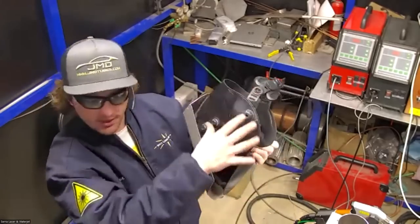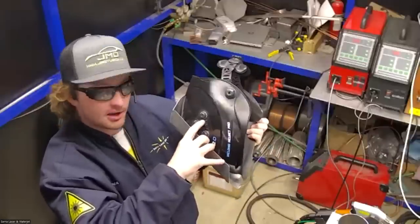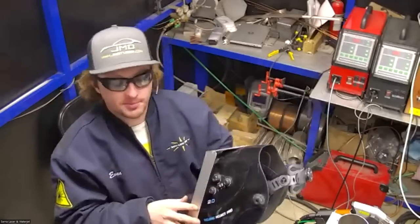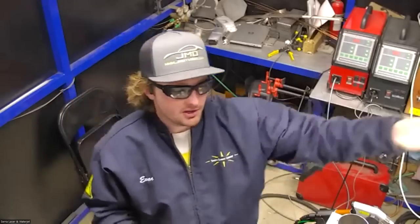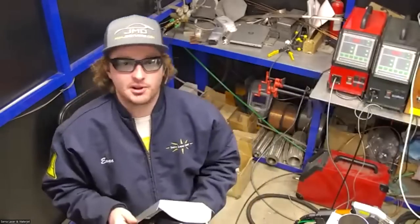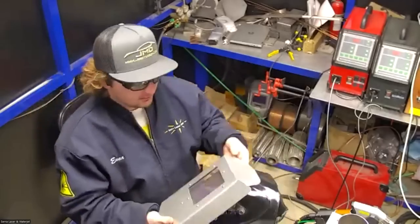You can probably tell that it's a real standard welding helmet here underneath. We're actually just going to put it on cut mode because there is no arc. There's no UV light produced by an arc, so it's not very bright. It's much dimmer than what we get with a TIG weld. In fact, I like to have a nice bright light source to help me see what I'm doing a little bit better. I have it on cut mode with a shade of 5.